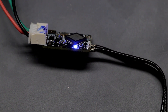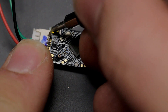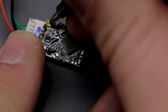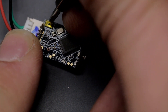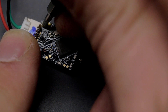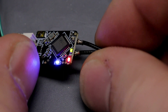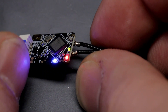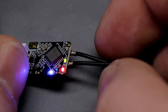The first thing you do is press this button down while plugging in power. In my case, I'm plugging it into a laptop because it's easier. You hold that little button down and it's supposed to enter bind mode. When it binds, you'll get a red flashing light and you should be good to go. So now what we have is a green, a red, and a blue — nothing's flashing though. This is the problem. This is not really in bind mode and we have no flashing light, no feedback that it's been bound.